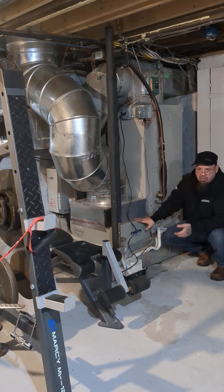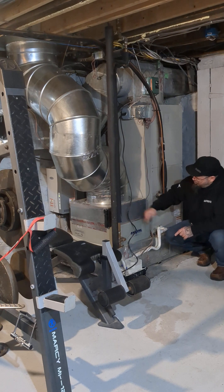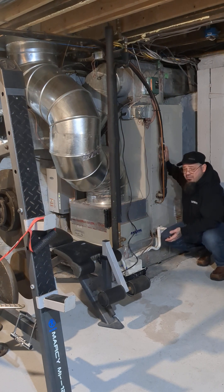It can be a chiller or cooling tower — there are other things that use fan coils. But in most household applications, you're going to have a boiler that is providing hot water to this coil. The water goes through the coil and it has fins inside. Then the air handler provides airflow to blow over the top of that coil and provide heating to the space.